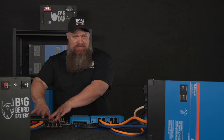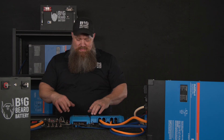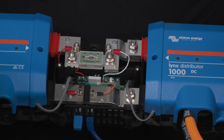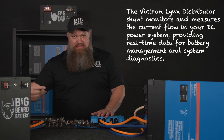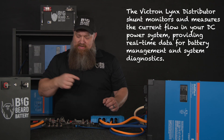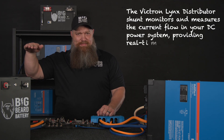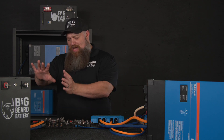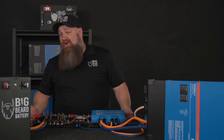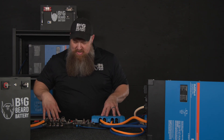We're going to separate the batteries on one side and everything else DC on the other, simply because of what's in the middle. In the middle — this is the gold — and this is what we call the shunt. The shunt helps to calculate how much total capacity I have in my batteries. It's reading the electricity flow as it discharges: you started off at 100%, now you're at 99% as the electrons go across. If I charge it, electrons go back this way, and it says now we're gaining capacity. This is the shunt. We isolate our battery side from all of our other DC loads, but we have one elegant solution called the Lynx distribution system.